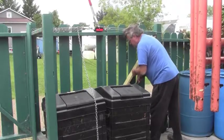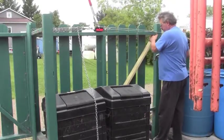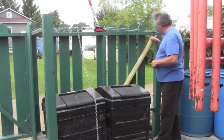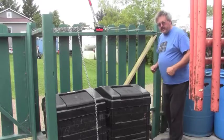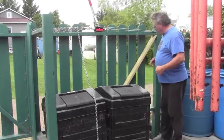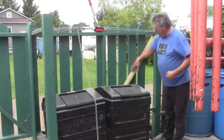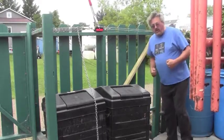Now, seam bottom, and that's tight, that's not going to go anywhere, and we'll just get our drill and put a couple of long 3.5-inch screws into each side here to get some pressure on the corner. Keep this one permanent here, and then we're going to go to the outside of the fence, and we're actually going to put 1.5-inch screws along here, and that'll just give it more holding power.